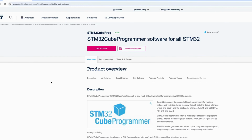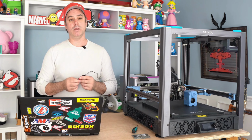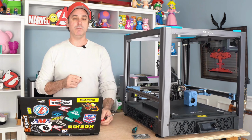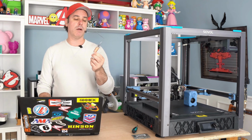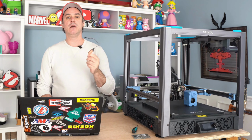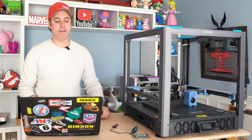So we need to go out to st.com and download their software. The link for that is in the instructions, so reference those for that part, and that's in step 1 of step 6. So once you have that downloaded, you can take this and plug it into the USB, and you will open that ST-Link software, and it should see this device over on the right side. You should see it come up with the serial number and all that good stuff, and that's how you know that you have a properly working setup. And that's why I also recommended getting a more genuine ST-Link. Some of the generic ones may not communicate properly, and you may have some issues. Again, link to this in the description down below, so you have it.